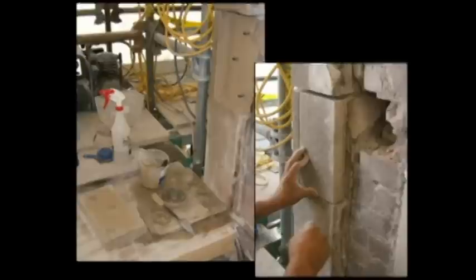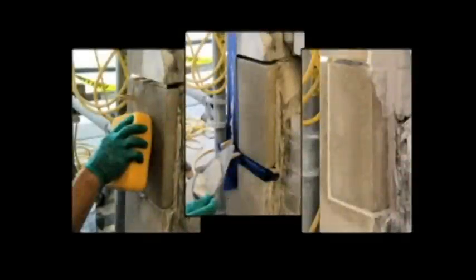Both the cut-out area and replacement stone are saturated with water to a surface-dry condition and given a preliminary coat of natural hydraulic lime bond mixture to ensure maximum bond strength. The lime mixture is applied to the replacement piece and then firmly tapped into place, aligned evenly with the surrounding stone. The replacement piece is carefully cleaned with a damp sponge, the joints are pointed in and left to cure, protected from weather for a minimum of 24 hours. Note the protective painter's tape applied to the stone to prevent mortar from smearing the stone surface.